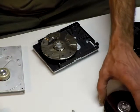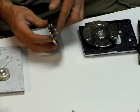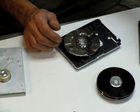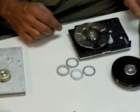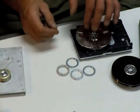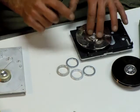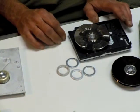One thing you have to be aware of is you might be taking a hard drive apart that has multiple discs on it like this one — there may be three or four discs on it depending on how new the drives are. You always have to build up because really all you need is one single disc. You've got to be able to build up these little wedge rings, and they're all different thicknesses. When you actually mount this drive, this plate here has to hold this disc down securely, and there's only so much room so you kind of have to create the right wedges to make that happen. Or just leave the whole existing thing in there together with the multiple discs, glue right onto the top one, and leave the whole drive together the way it originally came apart.